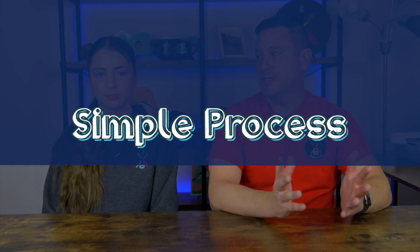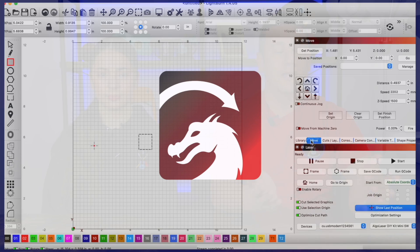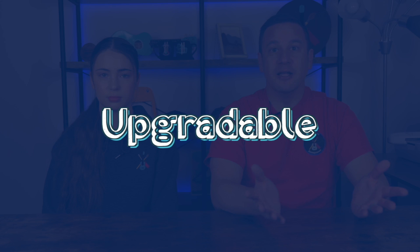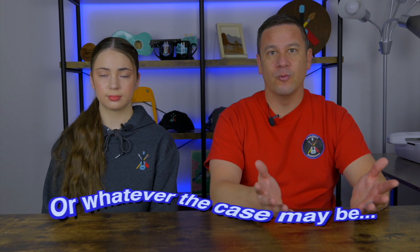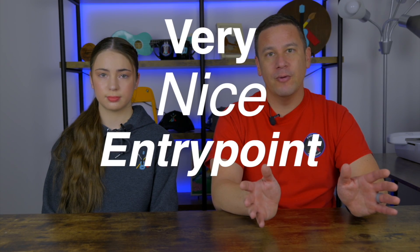So that's it — the process was pretty simple. The instructions were very clear to get this laser set up. It was easy to use and connectivity to the computer was really simple. It is able to connect to an app if you wanted to control it with your phone — we prefer LightBurn ourselves, but that setup process was really simple. We also like that this machine is actually pretty capable for a 5-watt system, more so than we thought initially. The last thing is it's a kit, so it's upgradable — we could switch modules, add air assist later, or whatever the case may be. That upgradeability and this price point make it a very nice entry-level laser.